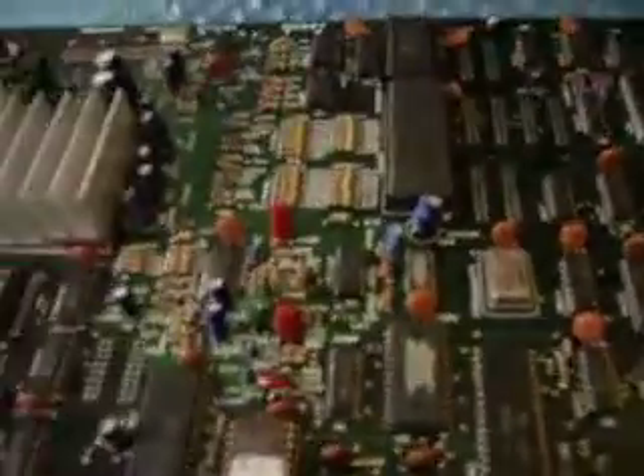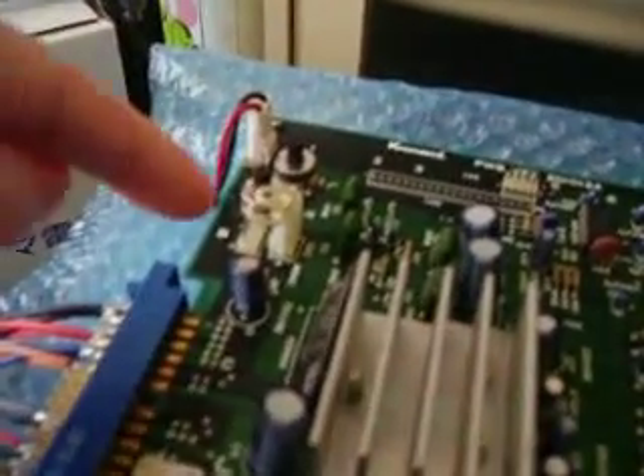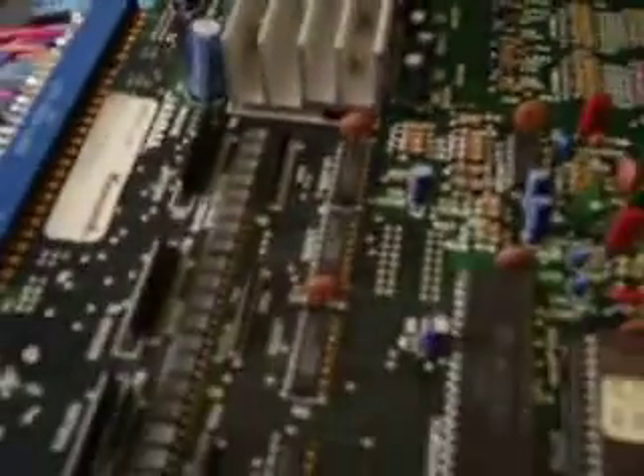I love stuff like this — the Crystal Oscillator reads 3.57 MHz. Three and a half MHz — shocking turbo speed now. This board does actually have stereo output, kind of like my Gradius. There's a jumper which switches between mono and stereo, and then the stereo connector's over there. It even has a massive power pole to connect the two boards. Original serial number: 130009.